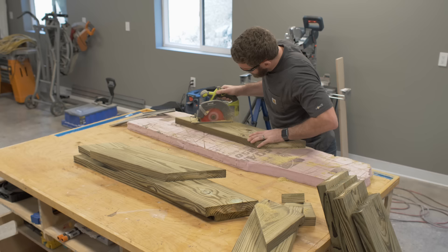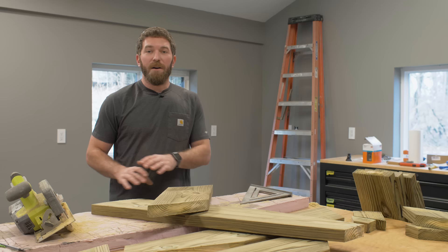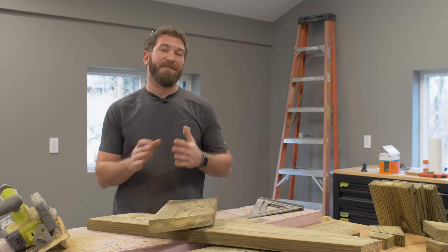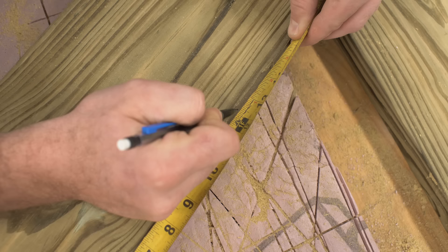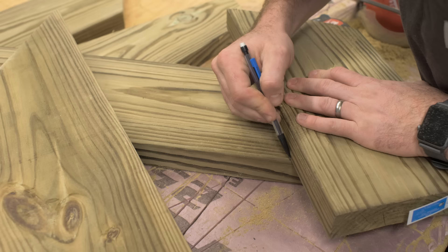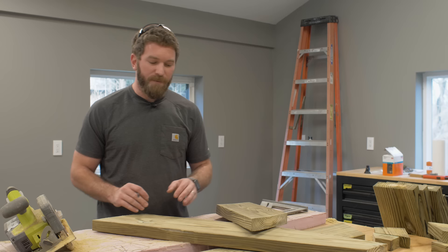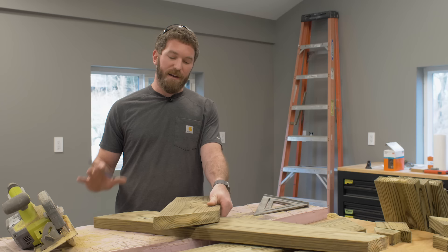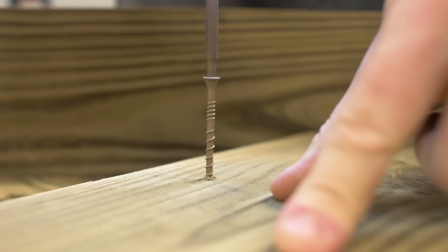The legs are going to be laid out like this — I'm going to lay the short board on top of the long board so that the wood screws are hidden from within the bench. We'll attach this with four wood screws, but first we have to find exactly where it's going to go. I'm going to measure from the point, come up twelve and a quarter inches, then measure from the back of the leg and come up five and three-eighths of an inch, making a mark at both locations. Once I connect those marks I'll have the line that this shorter leg will fall on. With a straight edge at the bottom of the feet we'll make sure it's perfectly flat across the bottom, then attach it with four two-and-a-half-inch wood screws.